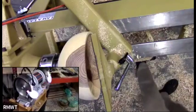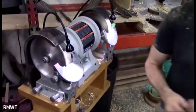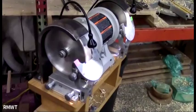But okay, something important. This cut's really important because this bowl is going to try and escape the cut. And two, it's already cut several miles of chips. So remember, at 40 miles an hour, if that's the outside periphery of the bowl, I'm cutting a mile of chips every 90 seconds. So every 90 seconds, the nose of that gouge, because remember the finish of my gouge comes from the nose of it, has cut exactly 1 mile.